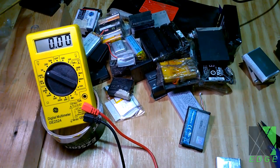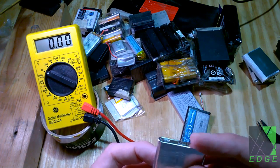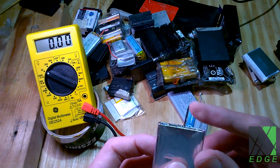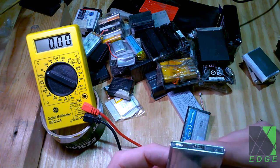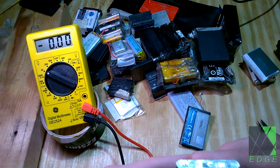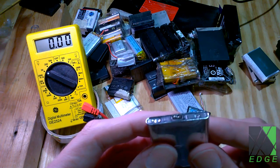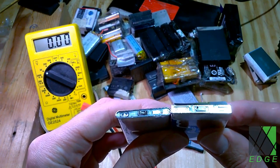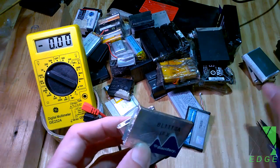It's very common that battery management circuits fail. In this case we have a BPC — battery protection circuit — not what I'd consider a BMS. It just sits around the top of the cell and protects it from overcharge and over-discharge. It appears to have done its job because all these cells are around 2 volts, which is not great, but when you figure these have been sitting around for who knows how long, it's not so bad. I now have two relatively similar BlackBerry cell phone batteries — I'll have to connect to them and give them a charge.